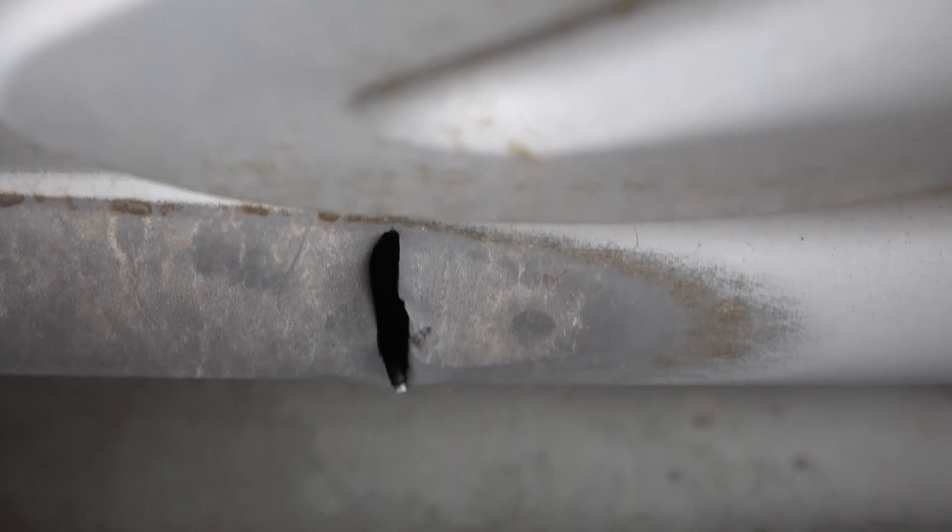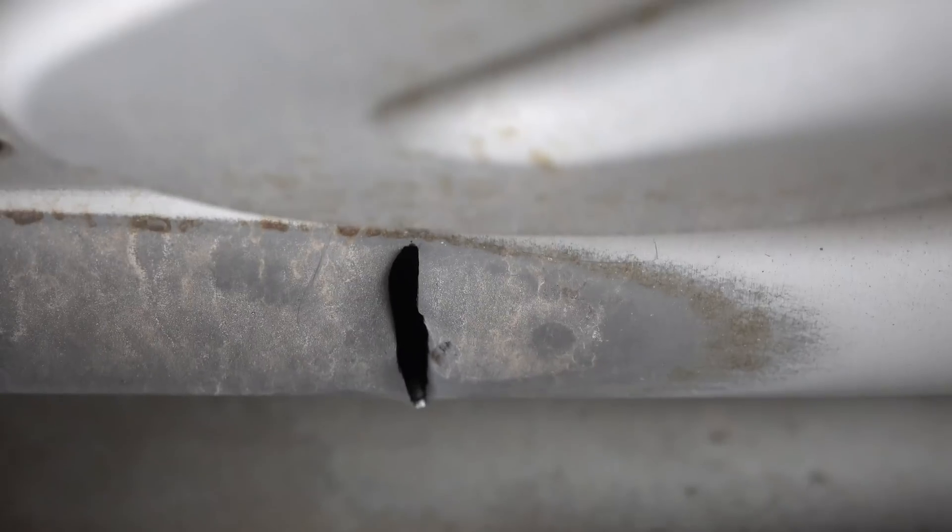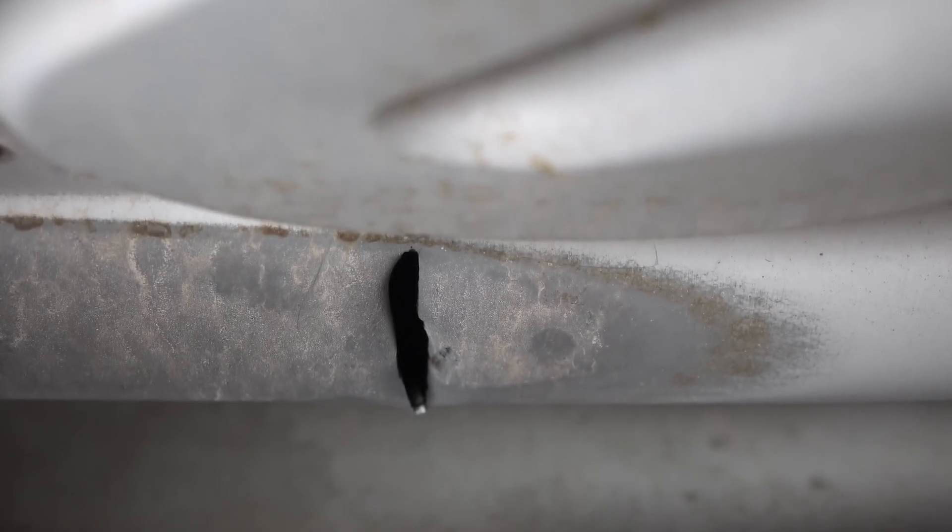This is one of the common places where cracks occur, and it gives you an idea what could happen if you have a cracked heat exchanger. This would kick off a rollout switch, although it might be a little slow on it, because the rollout switch is on the other side — but both of these would do the same thing.